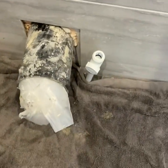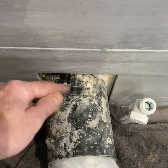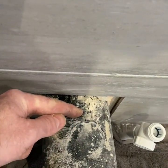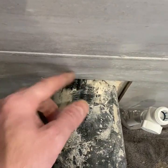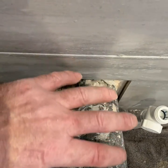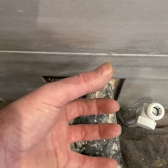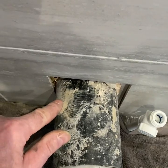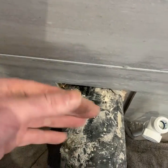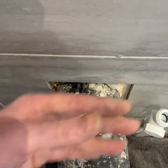So what we're doing here is, this is the old soil stack, so it wants to be an inch about there. I'm going to cut it off with my multi-tool, and then that fitting will go on there, and when the toilet pushes back, it'll be beautiful. But you'll be able to pull it out and push it back. Then this, we're going to go up, we're going to go across, then we're going to go up into a flex, so that'll be on a pivot. It'll pump it out and pivot in. Beautiful.